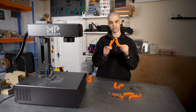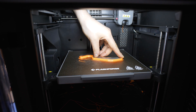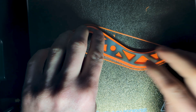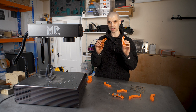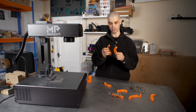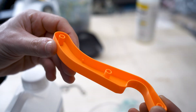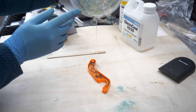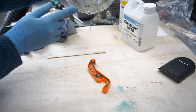The other option is inserting a metal frame mid-print — halfway through the print and then continuing, essentially locking the metal frame inside. I've got two versions: one is just a solid skeleton, and one is a skeleton with trusses in it, to see if there's any difference. And lastly, I'm experimenting with epoxy. I've shelled out the original design and filled it with clear epoxy. The other design has the truss skeleton inserted halfway into the print, then filled with epoxy resin so it's locked in there.